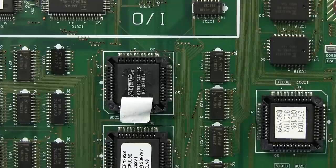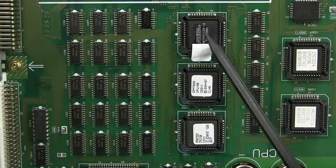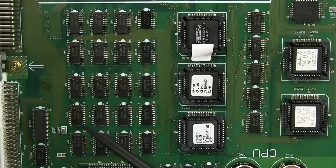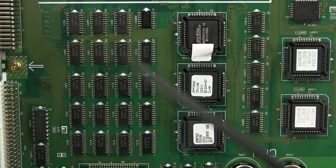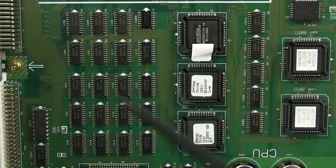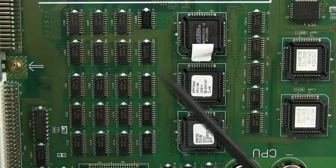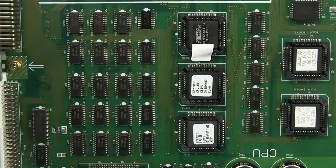You know, it's sort of an old school low density PLD. So they've just got some sort of glue logic, stuff like that, embedded in these things. But obviously not enough glue logic to fit in these. They've got multiple devices, but they've also got all this 74AC series stuff around here. And yes, it is AC, much higher performance than HC, of course, so that'll be chewing some juice as well, contributing to that 400 watt power consumption. But these days, of course, you'd fit all of that inside one FPGA or something like that. But hey, back in those days, they decided to use no less.